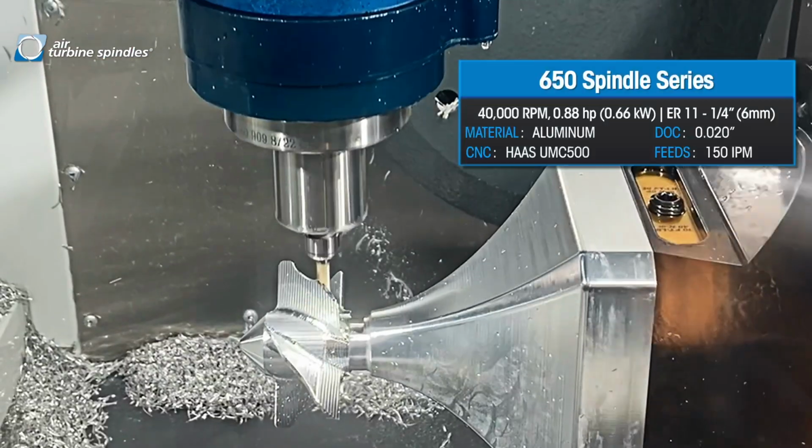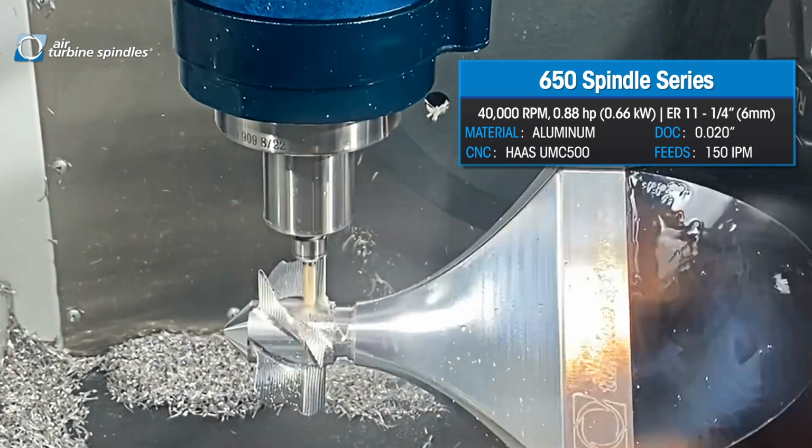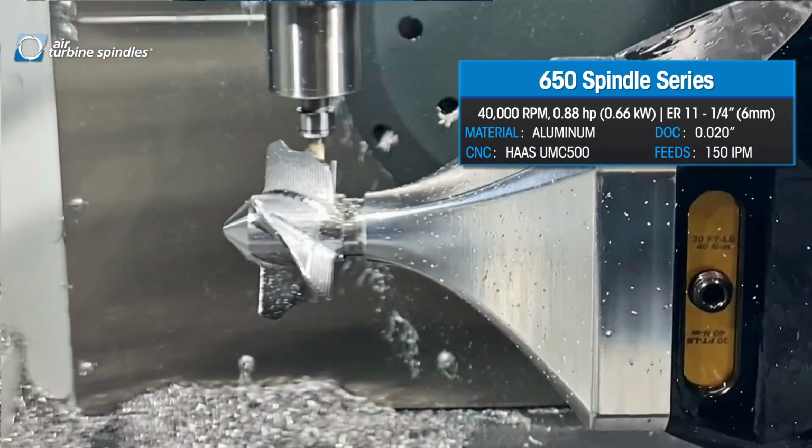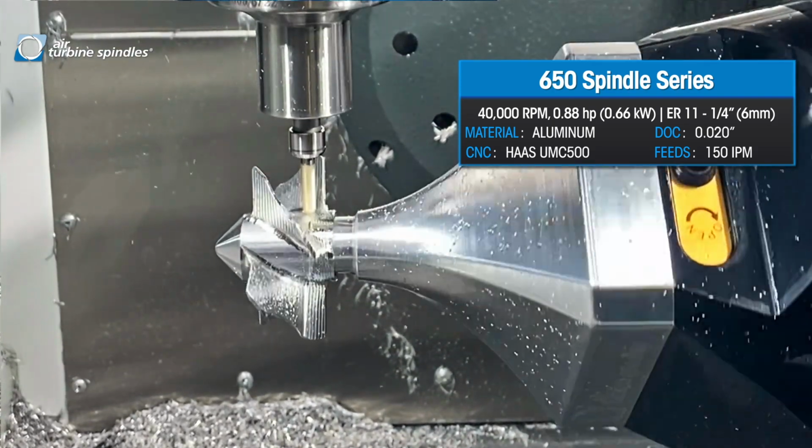Unlike the main spindles in the machine, you can let it run with air, and the air that you're using cools the spindles while they're running. In one of the main machines, you can run at 15 or 18,000 RPM, but it's very, very limited because then the accuracy falls apart because you heat up the spindle. Whereas with these spindles, you don't do that.